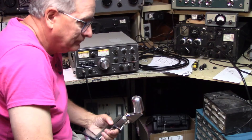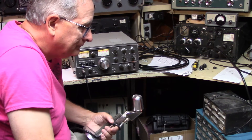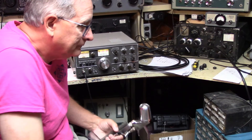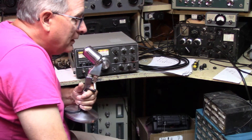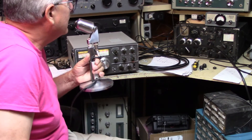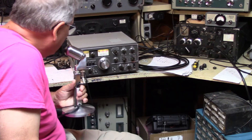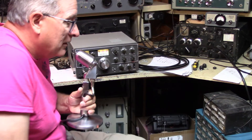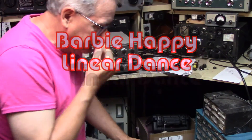Yeah Mike, you were a lot stronger in the high position, and you dropped off a little bit in exciter — dropped off a lot. Okay, back in the tune position. That's just exactly what the amp should do, because the meter is still pegging out. I need to get the proper wattmeter here for this beast — using the classic TS-520 exciter into the GSB-201 with four 811As. Yeah, it's sounding good too. Good audio on that.